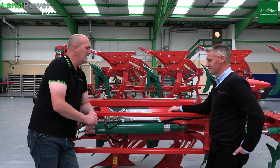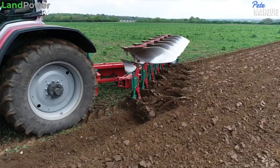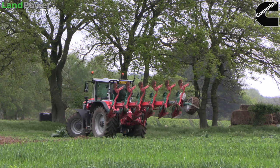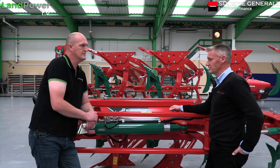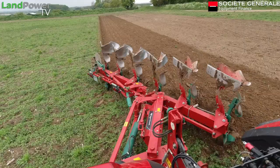When it's in on-land mode, will it sit closer to the tractor as well? It does, because of the parallelogram system. When we offset the plow - push the plow away from the tractor to go to the on-land position - it actually brings that front furrow slightly closer to the back of the tractor. So on the likes of lifting and lift requirement, it's slightly easier to lift the plow when it's on-land than when it's in-furrow, because it's potentially half a metre shorter than in the in-furrow position.